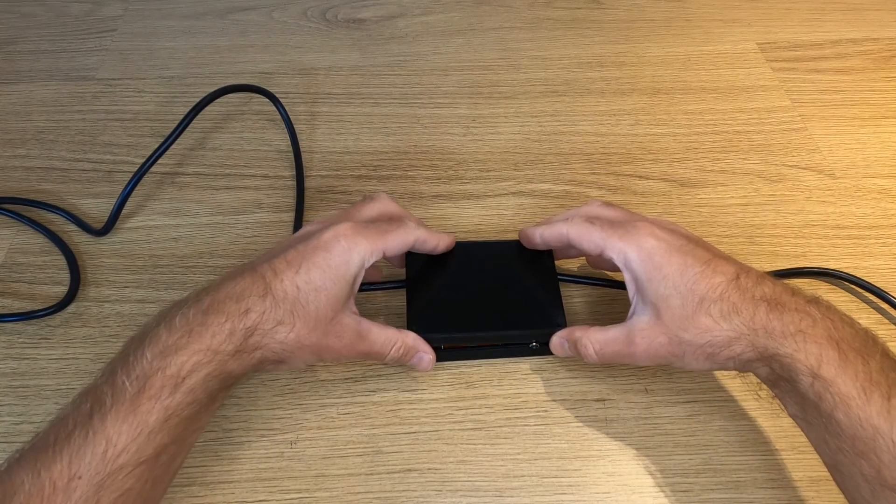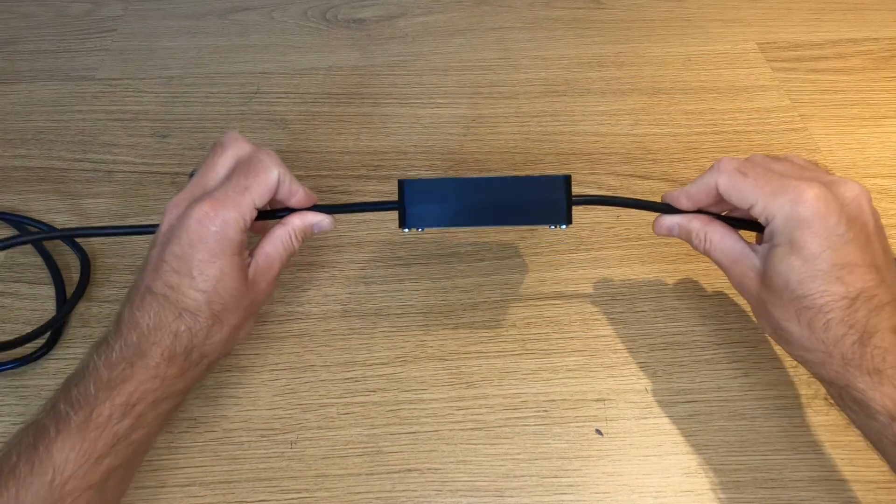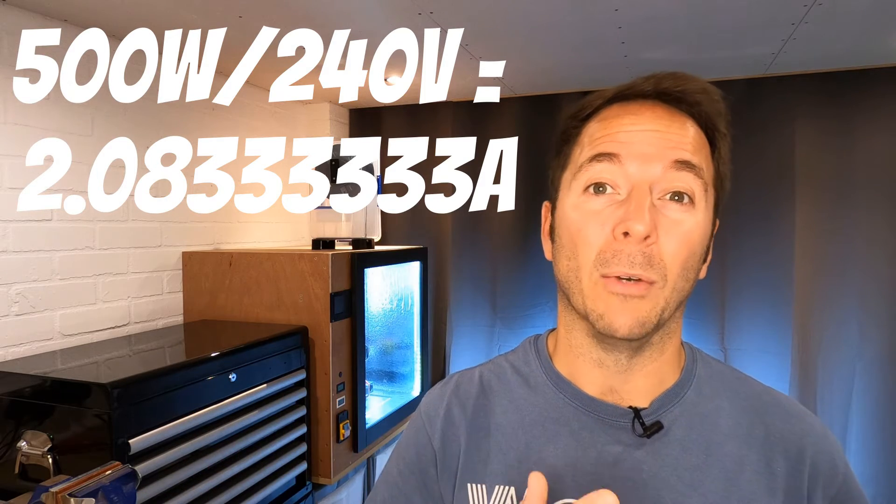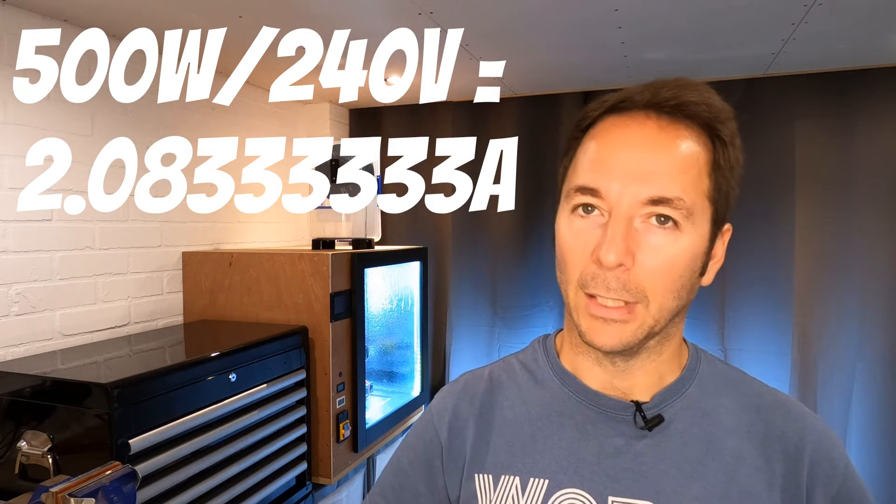Now that everything is doing what it should, screw the case top on. You should now have a fully operational power relay that works for up to 250 volts. Remember this relay is only rated up to 10 amps, so don't put any high load on the other end. With UK plugs there's a fuse in the plug — always check that fuse is not rated higher than the relay. That way, if you accidentally plug it into something drawing higher current, the fuse will blow before the relay does. My particular printer only draws about 2 amps, so a 5 amp fuse in the plug covers everything safely.